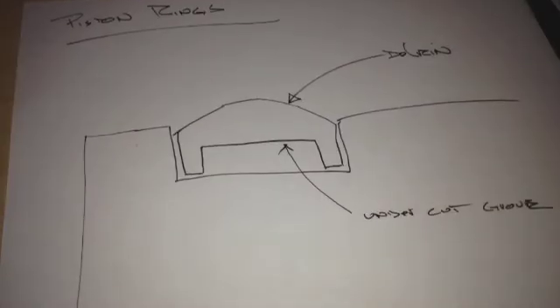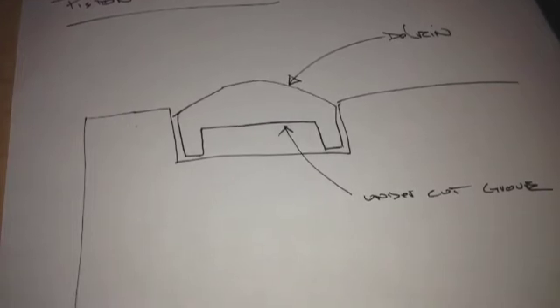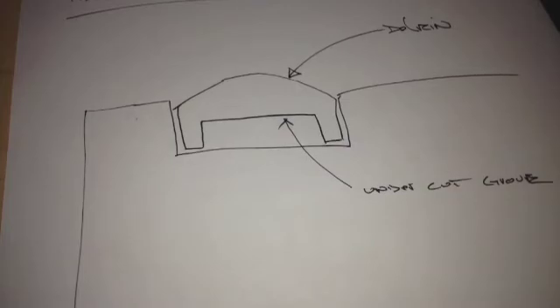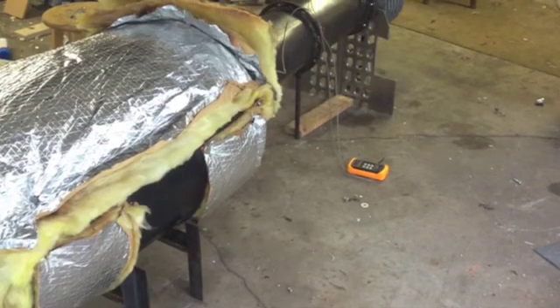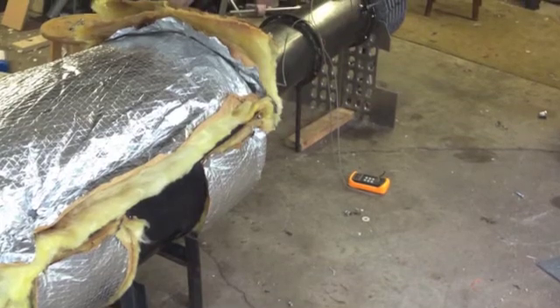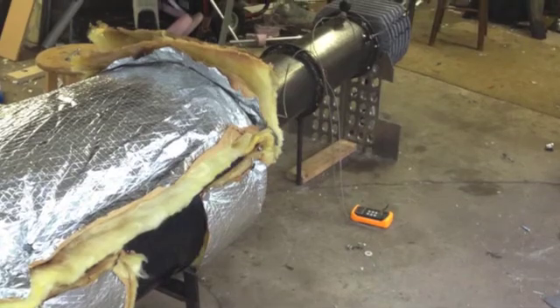In addition to the displacer, we did some work on the piston rings — this was kind of key. We had to create an undercut and then dome the top so we'd get a good sealing surface with the equipment we're using to develop those particular rings. Here you can just see the engine assembled. We've got two temperature probes in here and a simplified temperature readout.